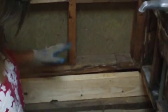And because we're a little weaker on this side, I'm actually going to take this out and just double this up so that I'm hitting some meat back here, because there's going to be downward force here, and I don't want that downward force to sort of pull that down. So it might be worth it just to get a bit more meat behind there. I'm just thinking about that right now.